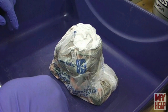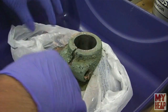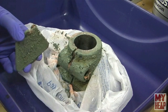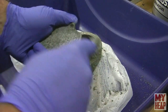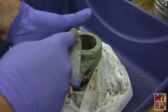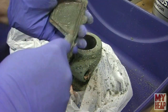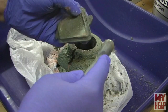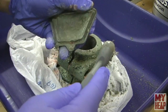It's the next day and this has been sitting wrapped up in the plastic for not quite 24 hours but several hours. Opening it up, the Citrus Strip is starting to work pretty good. What I normally do is just take a wire brush — and you can see it takes it right down to bare metal. After I brush the bulk off, I'll take it outside to the hose and give it a good scrubbing. If there's any paint left, I'll apply another coat. Citrus Strip does a great job provided it has ample time to work.